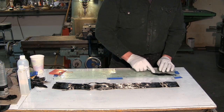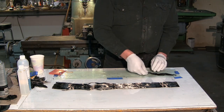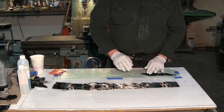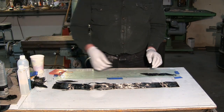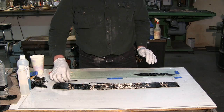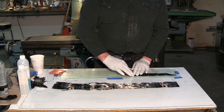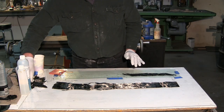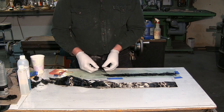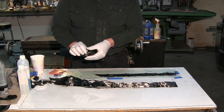If you use multiple pieces like this you can just slightly overlap them. The loads this layer is carrying are minimal — the main reason I use carbon fiber in this application is actually for cosmetic reasons; it makes it look like carbon fiber. The only problem with working with 45-degree carbon fiber is it's real easy to displace it and have it not be at 45 degrees anymore, so we've got to be careful of that.